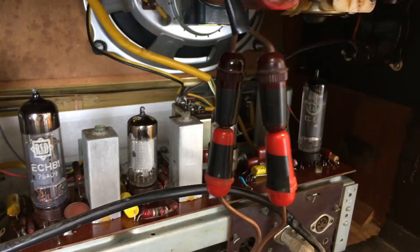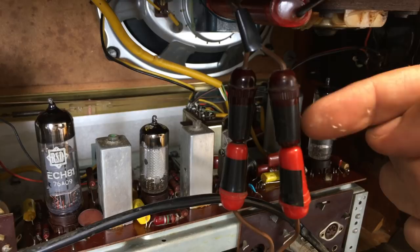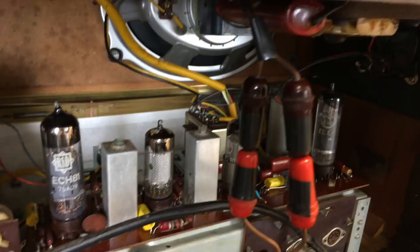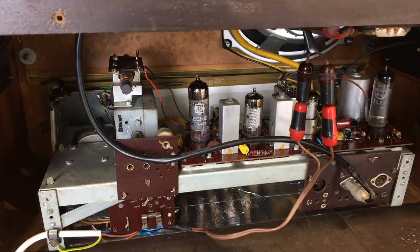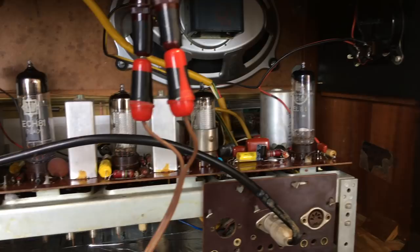The one thing you've got to be careful with is these connectors. They have 220 volt mains on there, or 240. So because there's a screw on here, if you inadvertently touch that, you get yourself a nasty surprise. So I just put a bit of masking tape or insulation tape around the screws. So that's now in place. Everything else is in place. Minus that appendage at the back, which really was doing nothing. And it turned out very, very well. I wired the speakers back on.